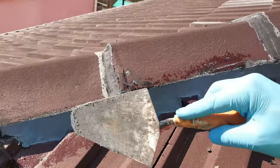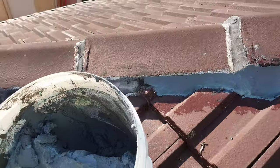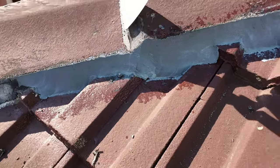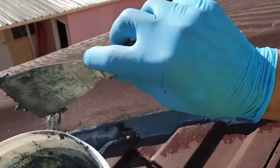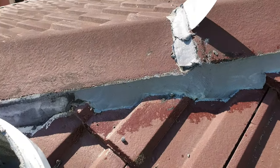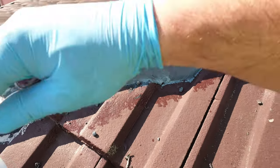Doing all the sides of the caps first, then doing the top later on with a spatula, works best. I've gone quite wide on some of my pointing as I haven't removed all the old pointing — this is okay unless the caps are loose. You'll need to re-bed loose caps. You can use pointing compound or just plain mortar.